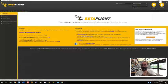Okay, we have finished part one, installing Betaflight, part two, updating the STM32 drivers, part three, updating the CP2102 drivers. So now what we're gonna do is take an example of what drivers you need to load in the event that you brick or crash your flight controller and you need to get back into it and load the firmware, okay? So let me give you an example of what I'm talking about.